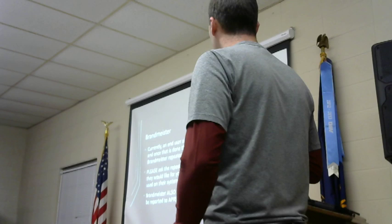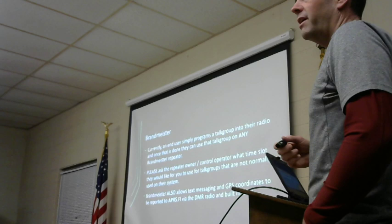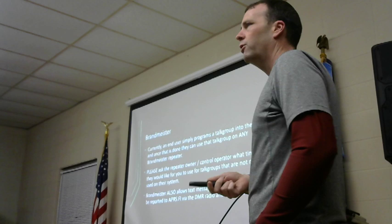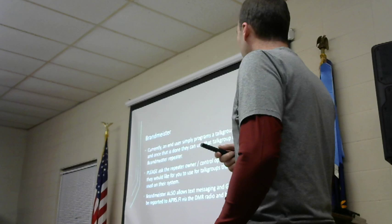So, I was talking about on the MARC repeaters, you have to know how the repeater owner has their repeater set up. You have to program this talk group on this time slot. With Brandmeister, we have certain talk groups that are static versus dynamic, and we'll talk about that a little bit more later.